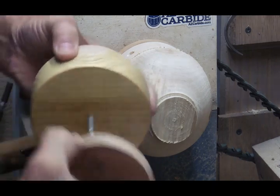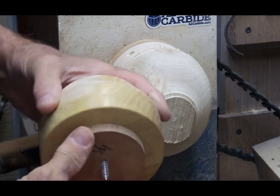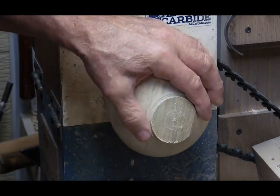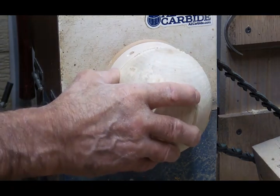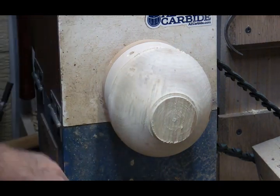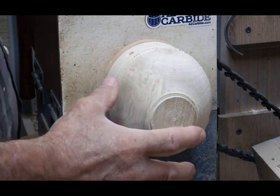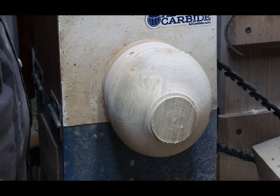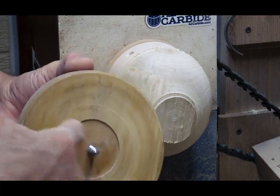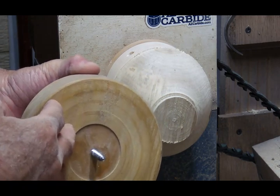This is another 1/4 inch one that has a longer screw that I have made discs for of various thicknesses, so I can put them on there to shorten this up. This one I had made because I have some small little blanks to make possibly Chinese teacups, sake cups, whatever, and if I put the blanks on a larger piece like this, then I'm going to be cutting into my screw chuck when I get up near the top of the profile if I am not real careful.